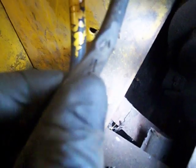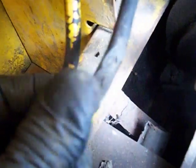When I was in here, I noticed that the main power cable, and this may be a common problem, I don't know, the main power cable has been sheared, and this tractor currently is a positive ground system, and I'm going to change it to a negative ground system. It isn't that difficult if you don't have a lot of gauges. And I'll try to explain. It's something I learned in vocational school that I memorized, and most people don't know this, but starters can run negative ground or positive ground. They'll turn the same way.